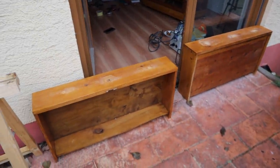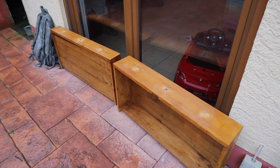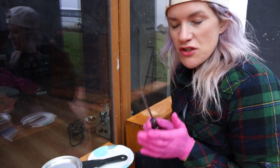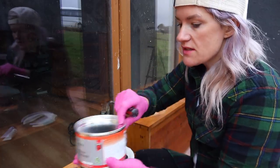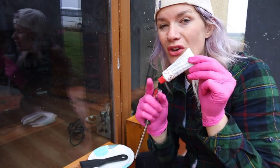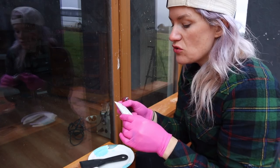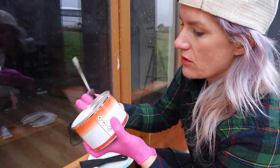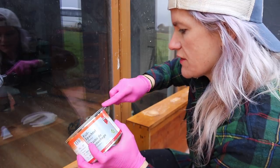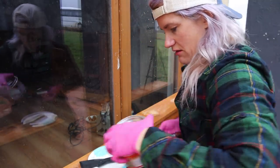This is what I mean when we say we're going to adapt and overcome — I have an overhang on my house that doesn't get wet and we're going to do our two-part wood filler on these little areas right here that are not getting wet. I'm going to be mixing a two-part wood filler. You can use Bondo; I think Minwax has one. This is the bulk of what you're going to be using, and this small tube is the hardener. The more hardener you put in, the faster it hardens. I use a flathead screwdriver to open it — be careful, don't stab yourself.